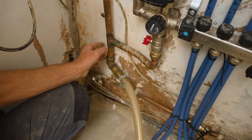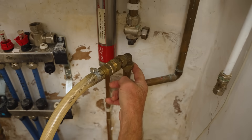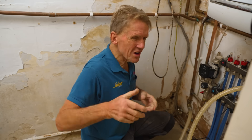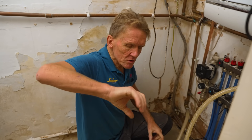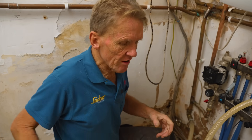I've made a small connection there - that's 22mm into the flow - and here on the return we've got the power flush hose going back to the unit. All it is is a very powerful pump and you can change it backwards and forwards, which is great because you can agitate the stuff, run it one way then quickly turn it and it'll run the other way.